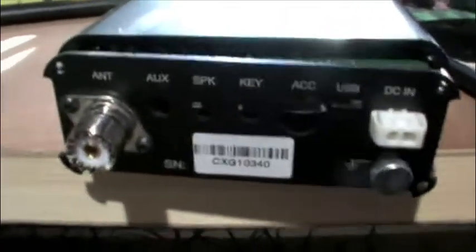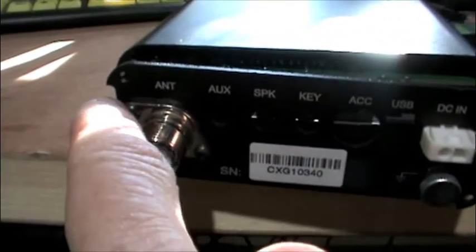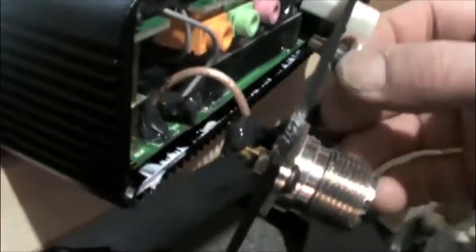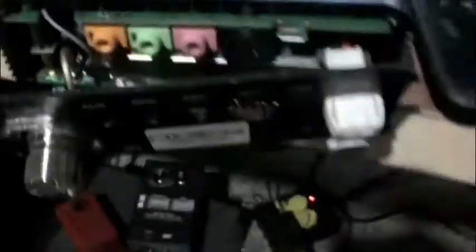So I'm going to try taking my little Dremel with a little sanding wheel on it, and just sand these off a little bit around here and around these holes, because I want to make sure when that's together the connection is good and you've got a good metal connection there. I'm also going to take off these screws here and expose a little metal — sand it down a little bit on the inside here where that nut goes on. I just want to make sure everything is touching bare metal. I will get on with that and show you what I've done.